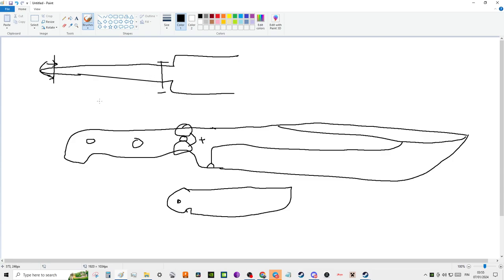Often you will see an abuse test, for example, from Joe X, you'll see very thin, and they're not even through tangs, they're halfway tangs in a basic little Mora knife that's only a few millimeters thick, outperform full tang knives. And there's a lot of reasons for that. Often what you see with full tangs like this is they'll actually crack from here to there, because you just have to be super careful where your stress risers are. And I think a lot of people watching this video will know where stress risers are.